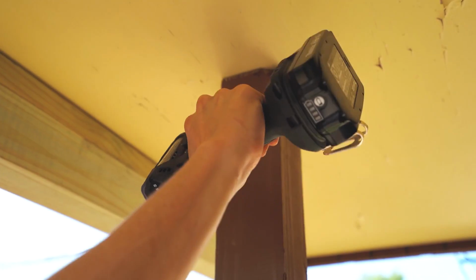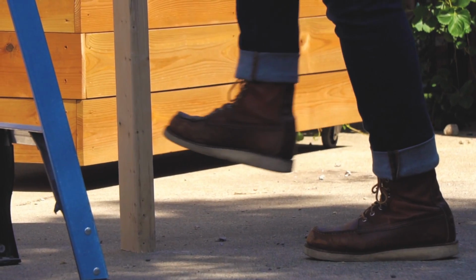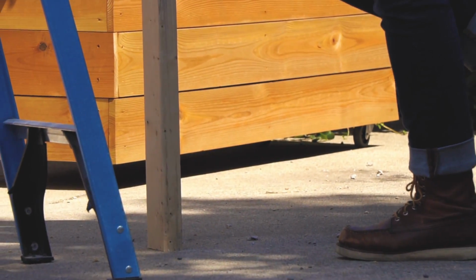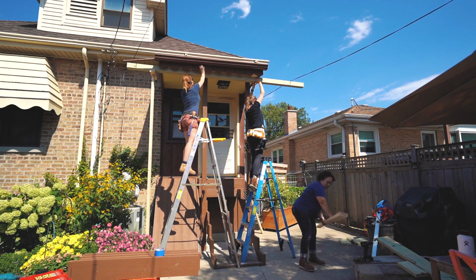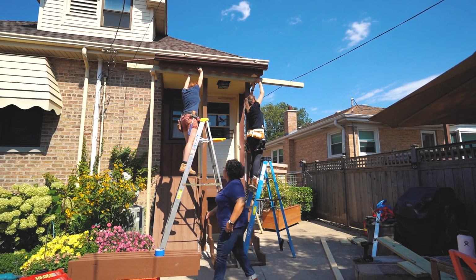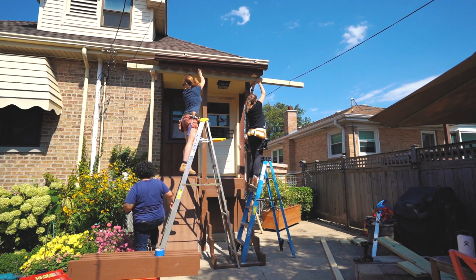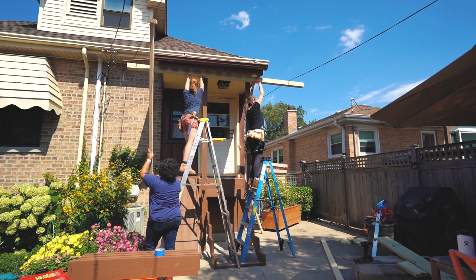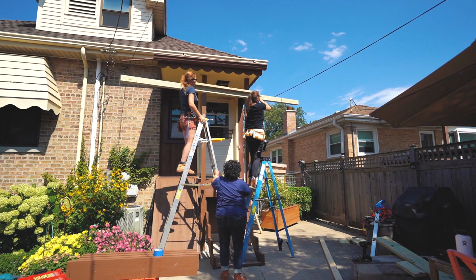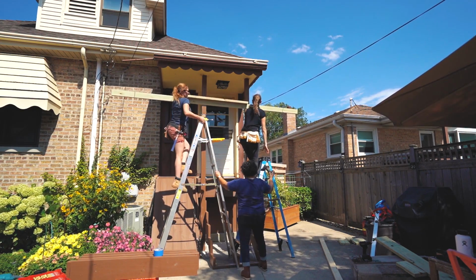We used 2 screws per side here, making sure to hit the rafters that were in range. Now that the 2 main posts were in, that header and its 2 props can be removed. We hopped up on ladders to first take out all of the screws holding the header up to the awning. Then, when Aaron and I were ready to support the beam, Alma kicked out and removed the vertical props. Oh, and in case you're worried, that is a phone line in the air, not power.